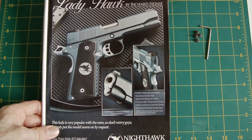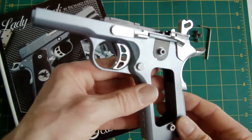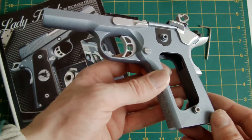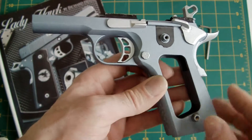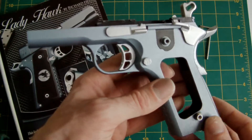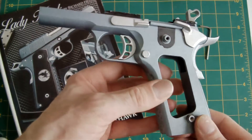It's now the assembly side and the frame is now assembled and this is it. As you can see, it's been coated in car spray — the frame — and it's been sealed as well with a lacquer. The car spray colour I used in the original video was Paris Blue, but that was too dark. I've now managed to get it a near enough perfect match. This is Tonic Blue — it's a Ford Halfords car match colour — and it was sealed with a clear Halfords car lacquer. It's pretty much an identical colour; there's hardly any difference at all.